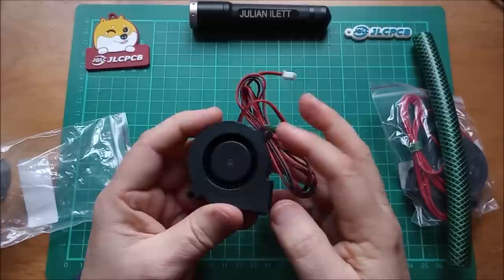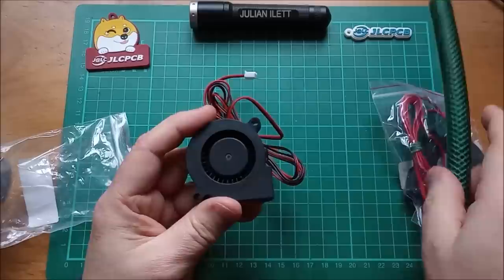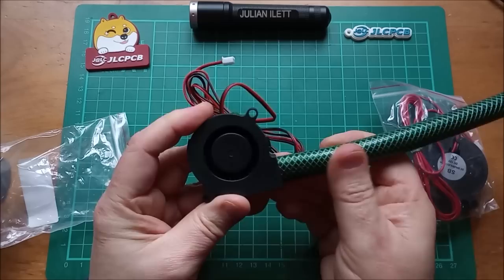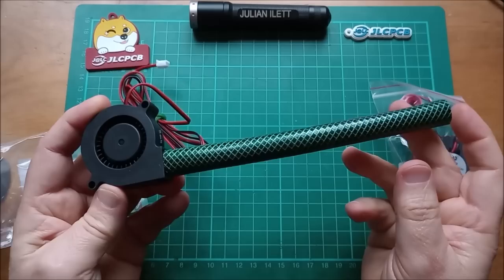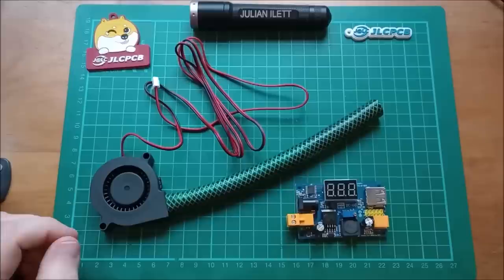The plan for this was an additional fan for my Ant Miner, which has fans for the hashing boards and the power supplies, but it doesn't have a fan for the controller board which appears to overheat. I was hoping to take this piece of garden hose pipe and shove it in there — which I think is doable, it still turns — and then direct it close to the SOC, the system on a chip, which I think is the component that's getting hot. So let's get a 12-volt supply and power this up.